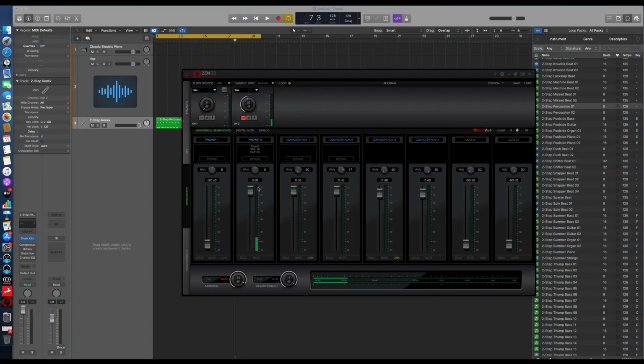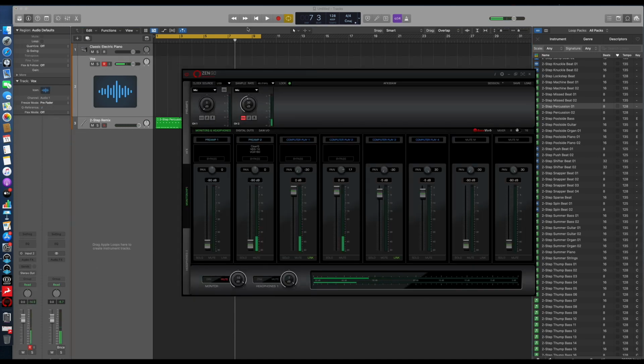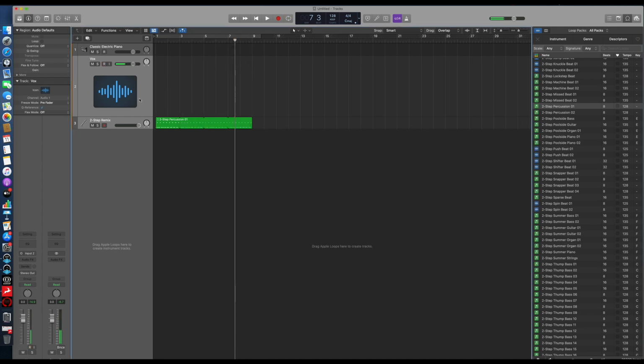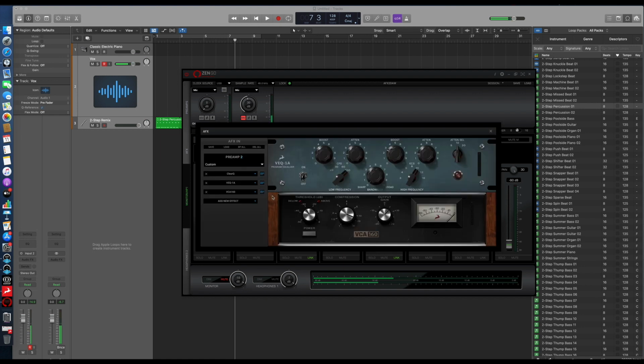Okay, next we can check my vocals through some of the FX plugins. Reducing the direct monitor fader and going to the DAW monitoring. You listen to my voice through the AFX plugin. Let's open the AFX instance. By putting the AFX plugins below the preamp 2, my voice will be processed through the AFX plugins and sent to the DAW input 2.